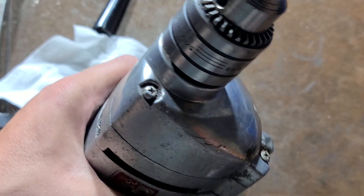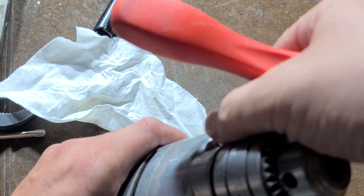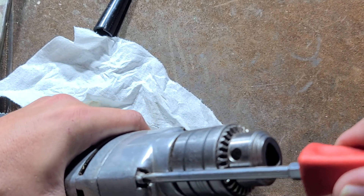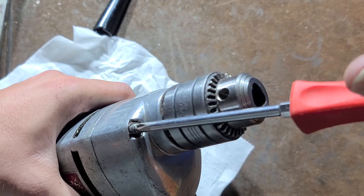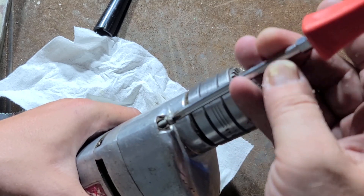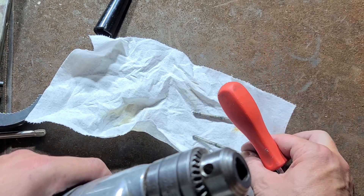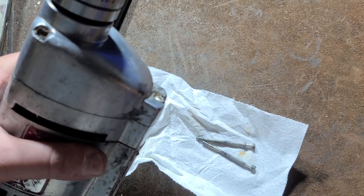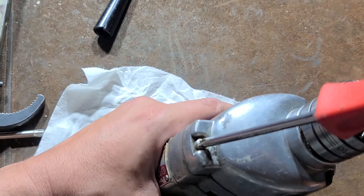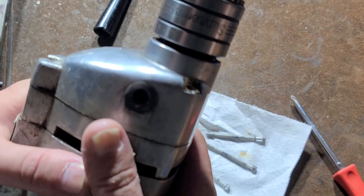Finishing through the other side, I saw it jump up to six amps. So this thing, even though it's rated for 3.6 amps, can pull a lot more juice and deliver a lot more power when it really needs to. Let's take a look at the gearbox. Should mention this drill has Phillips head screws, which helps date the tool — because of when Phillips head screws started becoming relatively common, older drills would all have flathead fasteners.